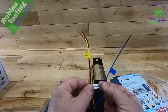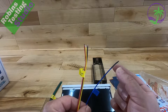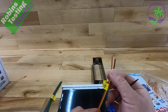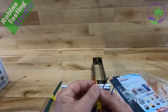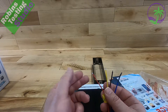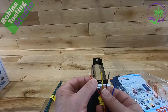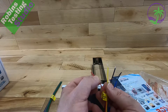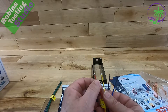What we have here is our remote, which is tagged remote — that's to turn on and off amplifiers, or if you have a powered antenna. They even heat shrink the end in case you're not going to use it. Over here we have three wires: these are the actual ground, the main power, and the accessory power. This is what turns the unit on and off when you turn the accessories on and off on the boat, ATV, quad, or whatever you have. This keeps constant power and feeds the amplifier, while the accessory wire allows the unit to get turned off automatically when you pull the key out.